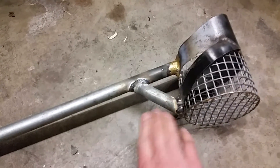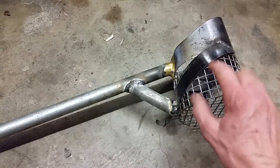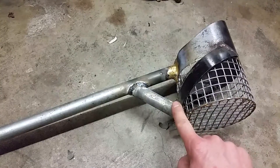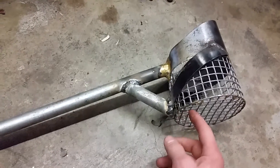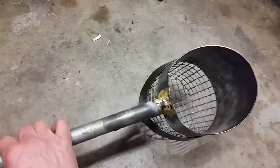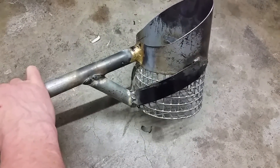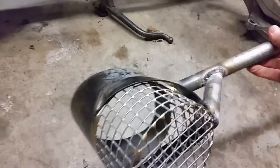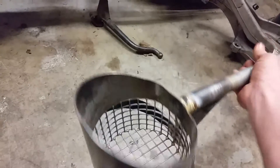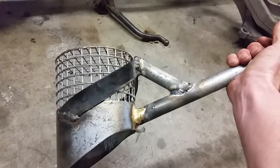This piece down here is bracing for when I stand on this to push the scoop into the ground prior to pulling it up. It's not welded to the cage, but the structure will hopefully give some strength so I'm not crushing or tearing the basket off the scoop. Those little metal straps that are black are quite fun to make because they don't just bend — they have a twist to them to go from the back to the front. The top was a little bit caved in; I didn't fix that. I was going to take the brazing off and weld it myself, but it looked pretty strong so I left it.